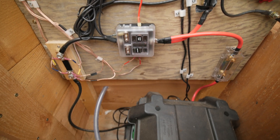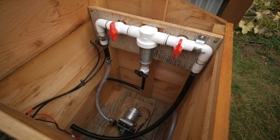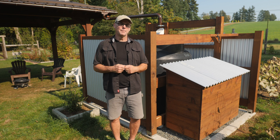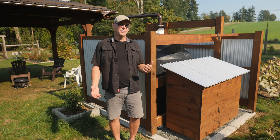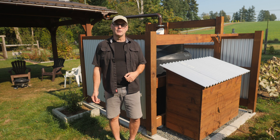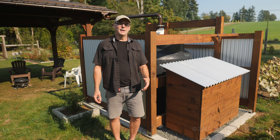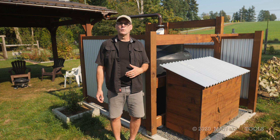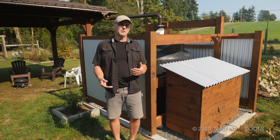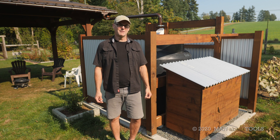Here's a few more shots of the inside of the pump house. Let me know your thoughts — I'm always interested in viewer feedback. I built this system with room to expand in the future and to power other lights and appliances around the pavilion next year. I left enough room in the pump house box to add another battery and maybe a small inverter if needed. The controller and system can handle more solar panels if the one I started with is not enough. I'd have to look into upping my cables and fuses to handle bigger loads, of course. Thanks for watching, stay safe and we'll see you next time.